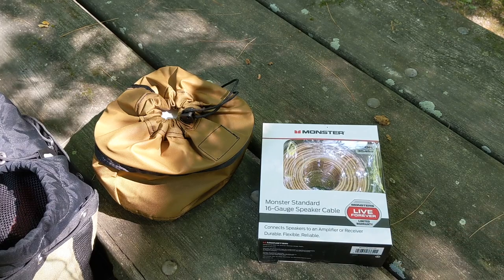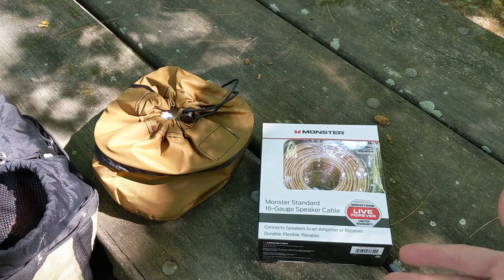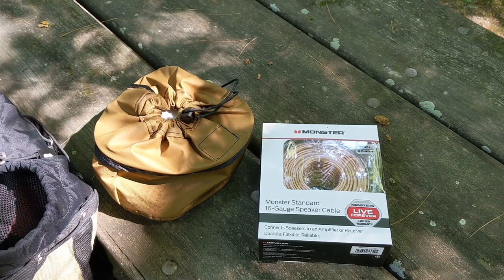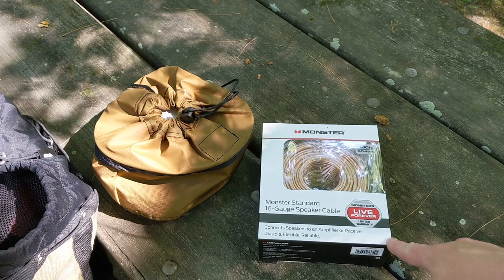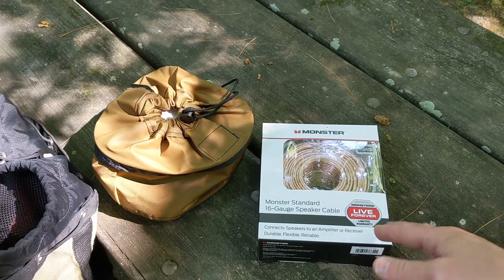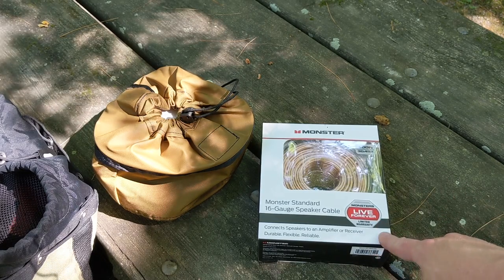Now, if you have a good antenna tuner, this will work. It needs to be able to match quite a wide range, though, to be able to do this. I can tell you that with the Elecraft KX series radios, if you buy their internal antenna tuners, I've found that they do a pretty good job matching these.